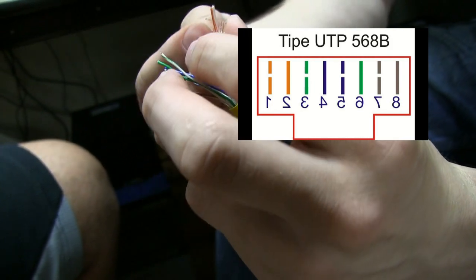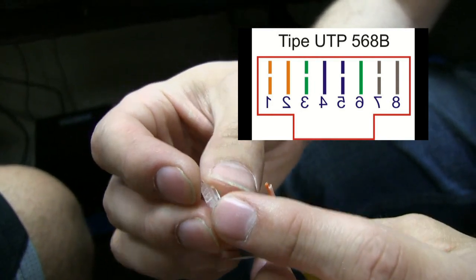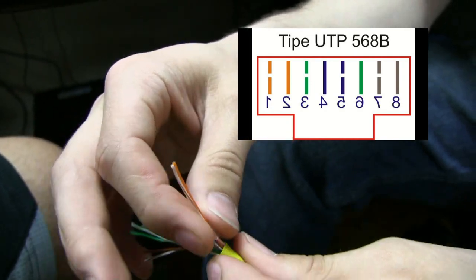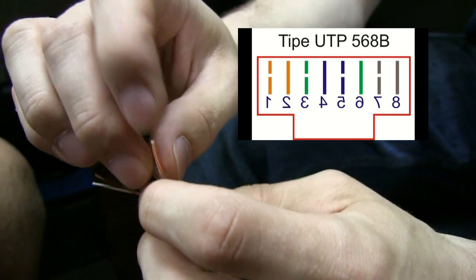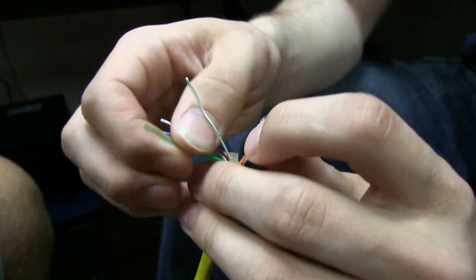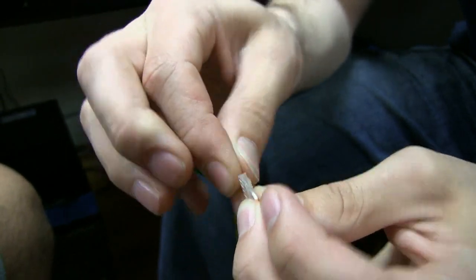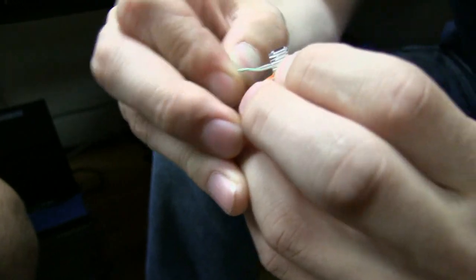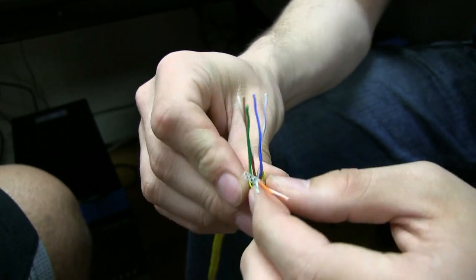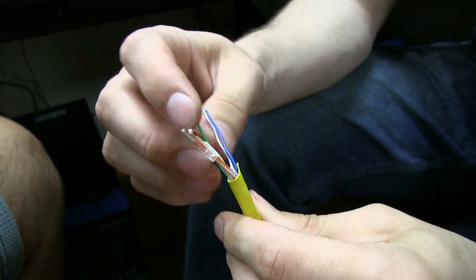So what you're going to do now is you're going to hold the first hole to where it's going to be on your left side. Take the cables. I like to put the first two in at the same time. Run them down. Orange white being first, orange being second. Then you get green white, and try to keep them from getting all twisted up. Put it in the third hole. Screwed up right there. Yeah, make sure to get it in the right hole, because that will cause problems. Slide it down, straighten them out, run it back up. It'll make the next steps easier.